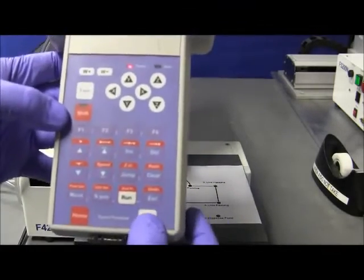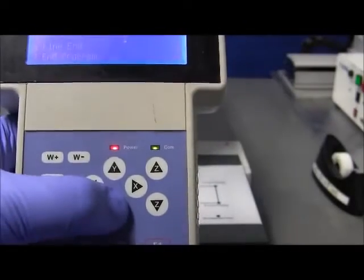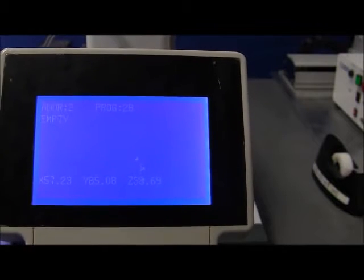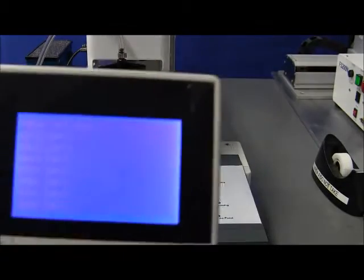In order to label that as the line start, I press enter. You will come up with the F1 menu, or the point menu. The first thing you should see there — the second one is the line start. So you scroll down using the movement keys as arrow keys. As you can see, the asterisk is the currently highlighted item. You press enter to select line start. It automatically goes to the next line. If you hit escape, you will see that on the first line, line start is already programmed in there, defined by that point that we moved into.